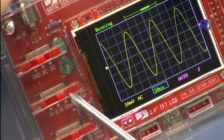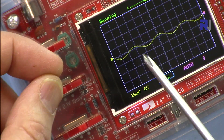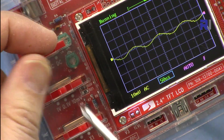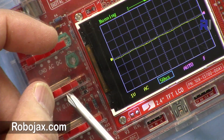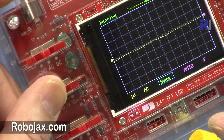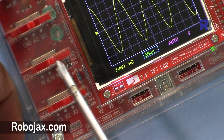The sensitivity is written here — 10 millivolts at the end, 100 millivolts in the middle, so the display becomes 10 times smaller. Then 1 volt is again 10 times more, so 10 times 100 millivolts equals 1 volt. That's how the scaling works — I'll put it back.